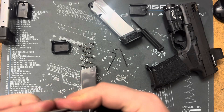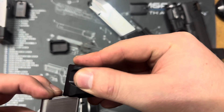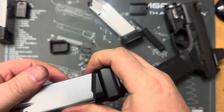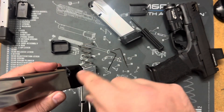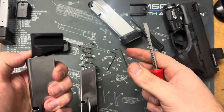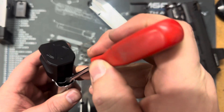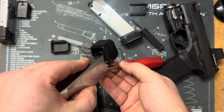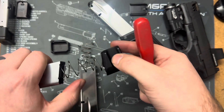It's weirdly at just the right spot to where it doesn't want to slide off easy. So what you'll need to do in order to remove the extension once you have it on: installing first, push it all the way down and the plus five will slide in from the back. Then back those screws out to the surface. But to remove it, just back the screws down a little bit and start to push it forward — right there is where it catches and it does not want to come off. So take a flathead screwdriver, grab that spring and push it down the best you can so it goes underneath that surface a little bit, then you can push it further and the spring will twist a little bit and then pop back into place.